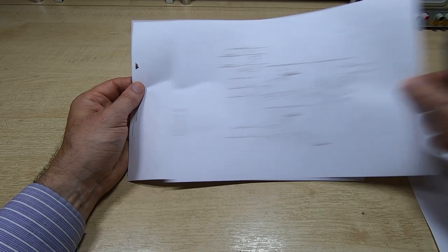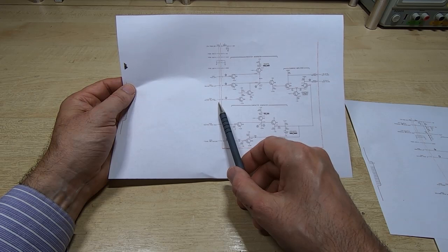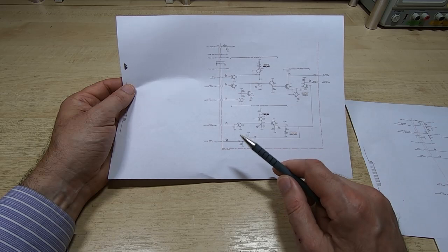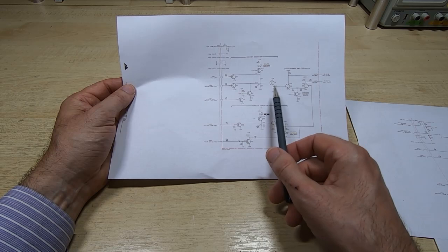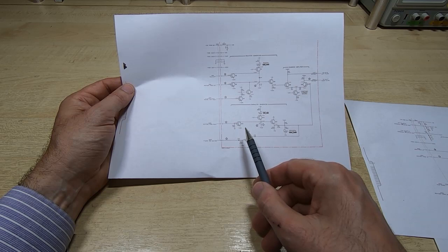The horizontal amplifier is very similar. The only real difference here is that it has a couple of additional control values. One is to enable the width of the display to be varied for floating point display. So if you look at the way the calculator works, and we'll come back to this in a later video, if you turn floating point on, you notice that the display gets a lot wider, and that's what this is for. And also there is a partial offset for the figure 1.